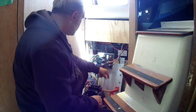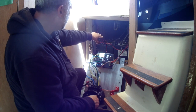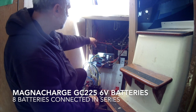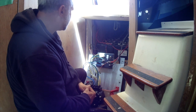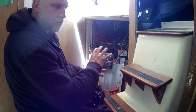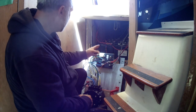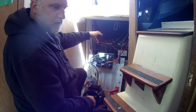It's got a 400 amp fuse here as well, so if something shorts it'll blow. In behind is my battery bank — I have eight DC batteries. These are from Magna and they are the GC225s, which essentially stands for 225 amps. At a 25 amp draw I have about 440 minutes. By putting them in series they generate 48 volts.